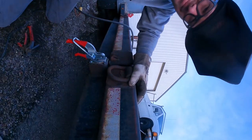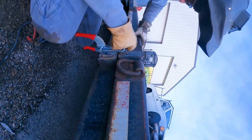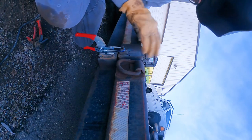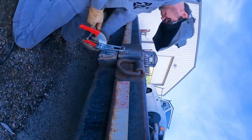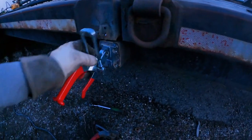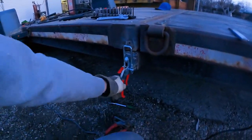Quite a bit better. It looks pretty good. I'm going to get the wire wheel to clean that slag off, and then get a ratchet so I can adjust this to the right tension so this trailer no longer rattles when it drives down the road. Dual shield really likes to run hot so that bead is actually really smooth. I don't know how long that bad boy will last before it gets broke off, but it's done.